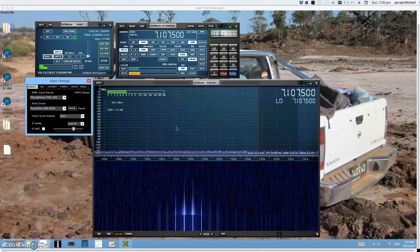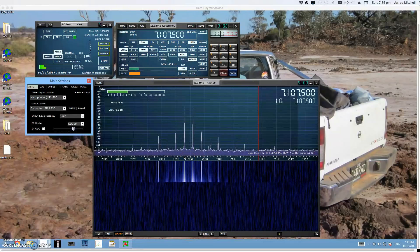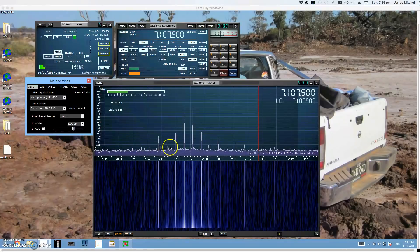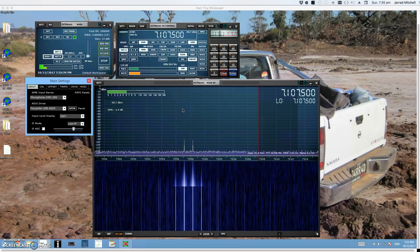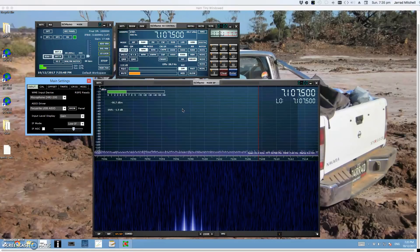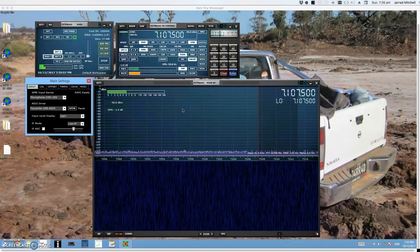We'll go down even further to 10 watts. This is quite an interesting pattern — you can see IMD3 is strong, IMD5 has pretty much dipped away, but some of the higher-order harmonics are starting to pop up. Counting out 9 divisions, that's 9 × 5 = 45 dB down on center tone, or 51 dB down on PEP — the ARRL method. That's really good if you're going to use this at low power running a low-power amp, but keeping it controlled is very important. It is very hard to keep a 100-watt PA stage under control.